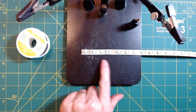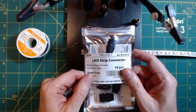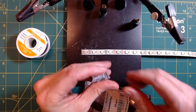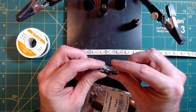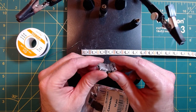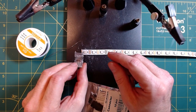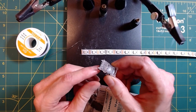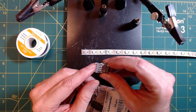There are alternatives to soldering for joining strips — you can actually buy strip connectors. Just make sure you buy the right ones for your particular strip. You simply insert the two ends of your strip, snap these down, and they puncture the strip and make connections. To be honest, I've not used these, so I don't know how well they work. They also come in 90-degree angles for joining strips at a corner. I prefer to solder my strips together, but these are an option if you don't have soldering equipment.